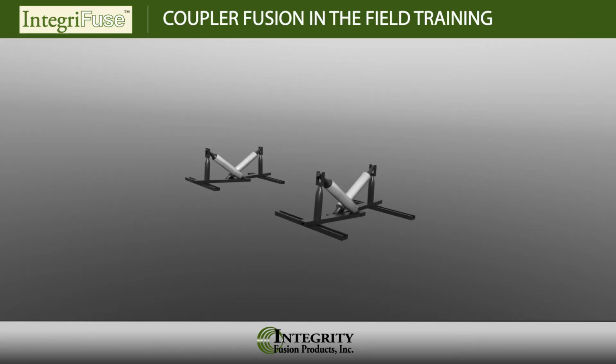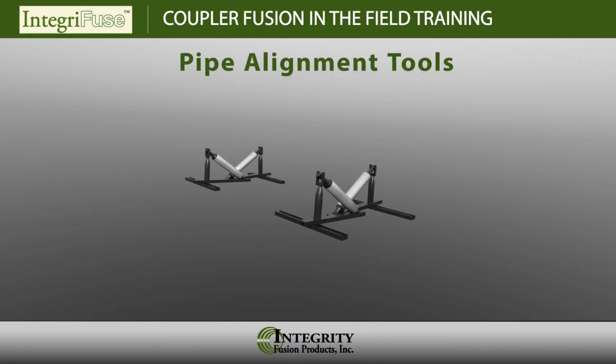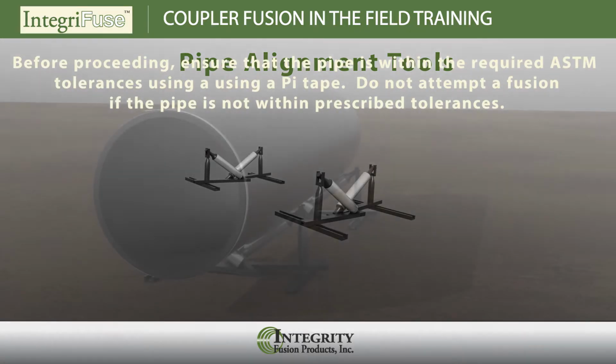Pipe alignment and restraint equipment. We recommend the use of some form of pipe restraint and support be used for the purpose of controlling and eliminating any movement or any external forces being exerted on the pipe or fitting during the fusion process.